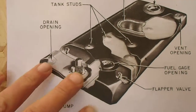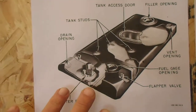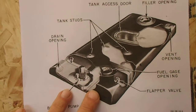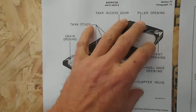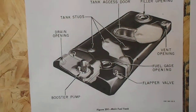Now the Air Accidents Investigation Branch tell us in their report that the right-hand fuel cell remained undamaged and that they were able to measure, I think it was 26 gallons of fuel in it. They couldn't have. If you also think that when the aircraft was banked at 60 degrees, all the remaining fuel, when that was torn away, it would have just poured out. So it could never have happened. Also, that fuel cell has been ruptured. There's no smoke or fire damage under here, which is very odd.